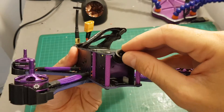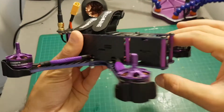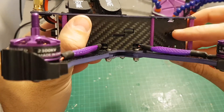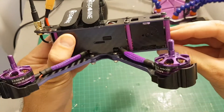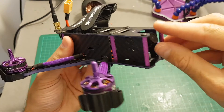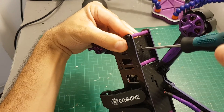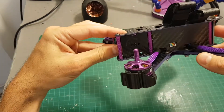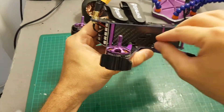The camera angle can be set by loosening the two screws on the side of the camera. There's also an angle meter that lets you set it from about 70 degrees down to zero degrees, which is parallel to the ground. I'm going to set it to about 50 degrees. Just hold the camera in position while fastening the screws, otherwise it will move — and now the camera is well secured.